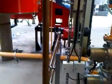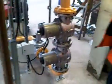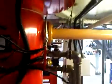We have dual fuel — we have a light oil pipework coming from our pump here. We have modified the gas train. Our gas now comes in from here, along the ground, through the gas regulator, through the main solenoid, and up into the lid to the burner.